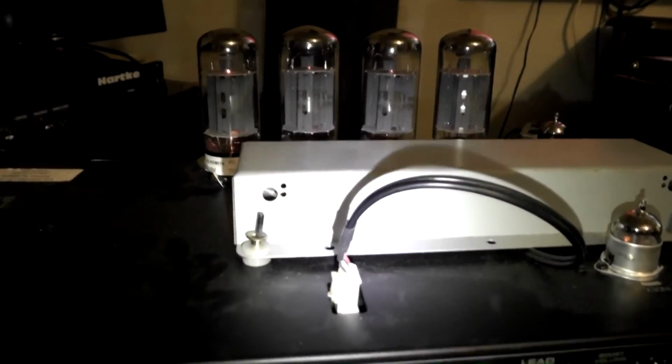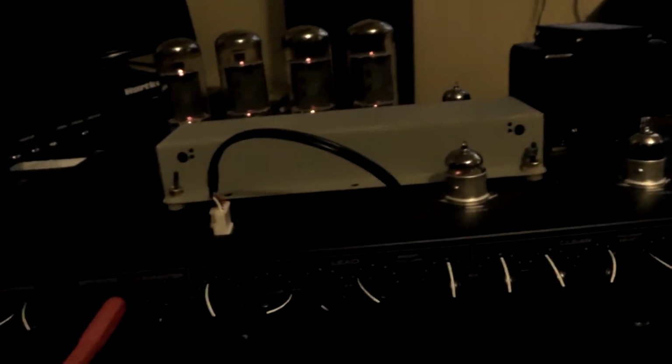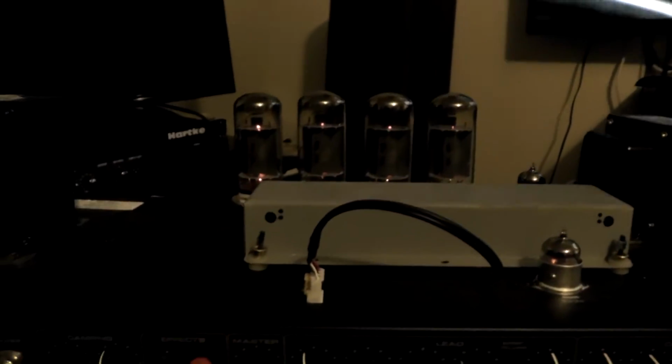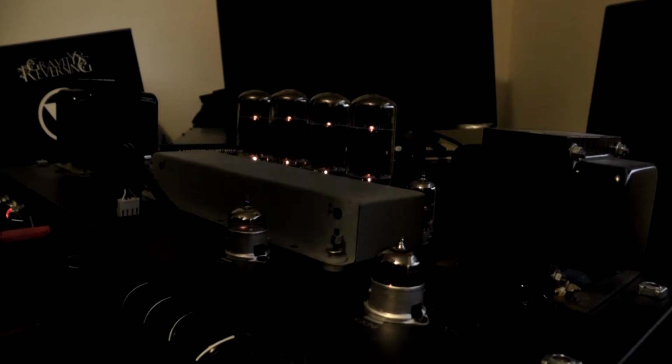In doing so, I determined that we have a problem in the power tube. After quite a while of playing, just a little while ago, I realized that these two over here seem fine. These two over here seem very underpowered. Since these things are in matched pairs, it's either that we have two of them going bad or one of the channels of the amp going bad. Now I'm going to play around to see what kind of tone we get. It is weird going into a bass amp, but it's also fun.